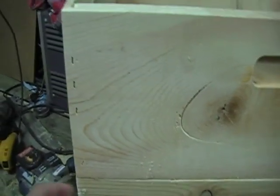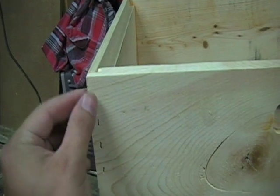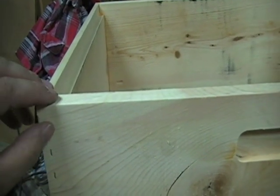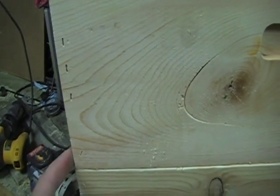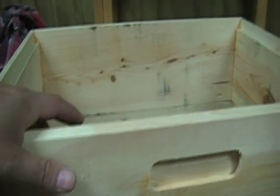For one, it's a tedious joint. It takes a lot of time, and it's actually weaker in the long run. In the long run, you've got more end grain. You've got end grain on this plank and this plank exposed at 50% per plank. Then you'll notice a lot of your old supers that have box joints, the top and bottom finger will be rotted out quite early compared to the rest of the plank and the serviceability or usability of the entire super.